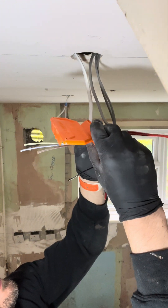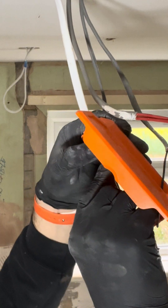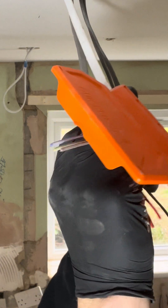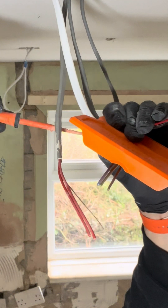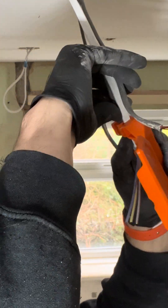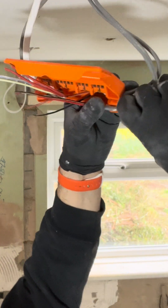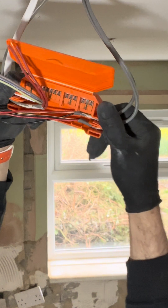So let's get them inside this box — I know for a fact that this is tight. I'll get that inside there beautifully. I'm going to get the switch wire for neutral going to the lights, and then the switch wire coming in the same end. Then we'll get the live and neutral in this end, and they're all in there ready to be terminated.